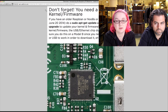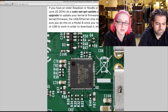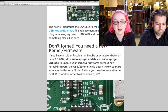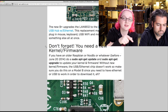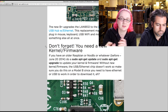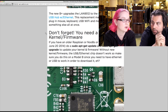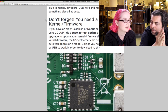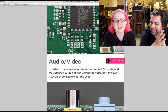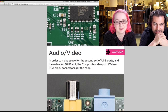This requires a new kernel update. If you have an old Raspbian, XBMC, or Raspbmc disk, you'll have to do an upgrade. The problem is you need internet to upgrade, so you have to upgrade it on your Model B and then take that card over to your B Plus — because if you plug into your B Plus, Ethernet and USB won't work. It's like a catch-22: you need to update your kernel with USB, but you don't have USB because your kernel needs to be updated. We discovered that when we tried to run an Ethernet cable and even that didn't work.